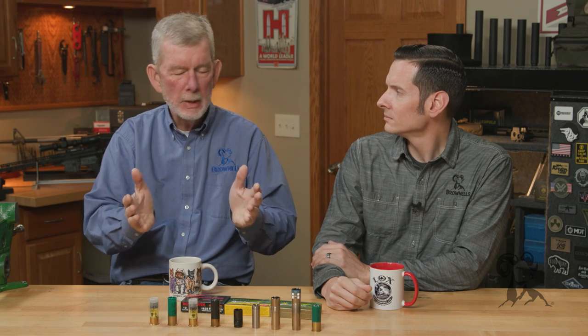As far as actually blowing up at the end — it's not going to happen. But there is a lot of flex that happens at the end when you do shoot steel shot. So if you've got an old Browning Superposed or something where you've got solder joints up there holding two barrels together, you don't want a lot of flexing going on — you can definitely break that joint at the end. So take it easy on the old guns with the fixed chokes, and I stay away from steel shot on older guns pretty much.